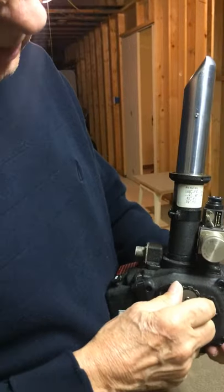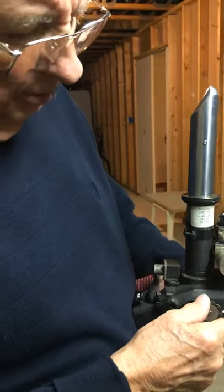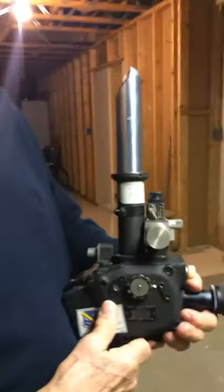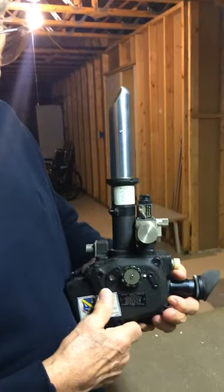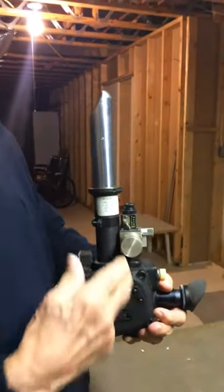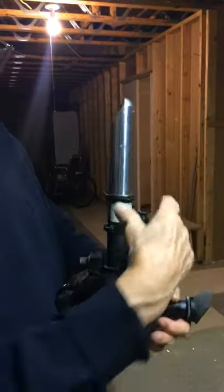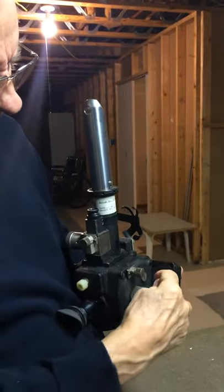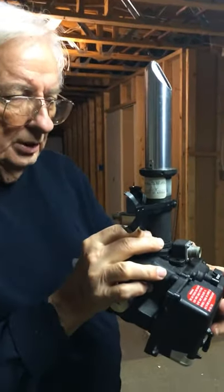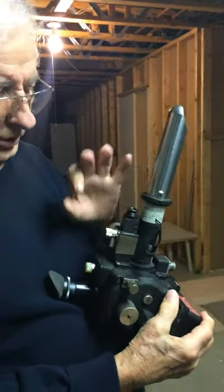If you were going to look at the sun, you want it to be just a little orange dot — not a glare to burn a hole in your eyeball. You can shoot stars during the day too. A bright star like Sirius or Venus, but you couldn't find them unless you had the calculations done in advance. You'd put the information into the sextant — Venus will be this high in this direction — turn the sextant to that direction, and when you open the shutter, the star would be pretty much in the center of your field of vision.